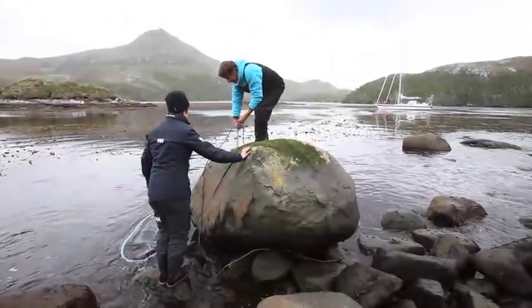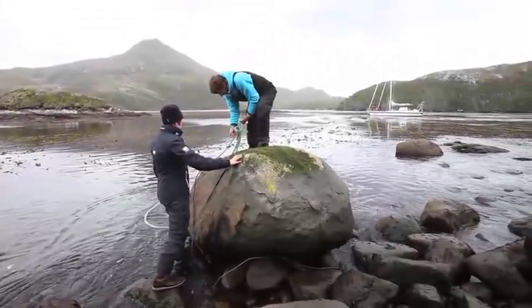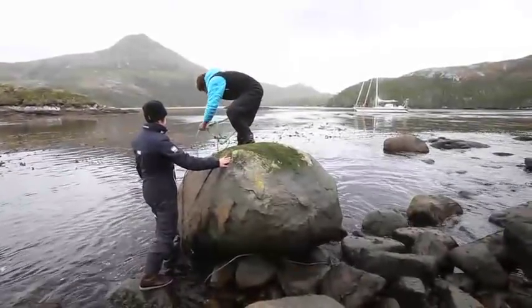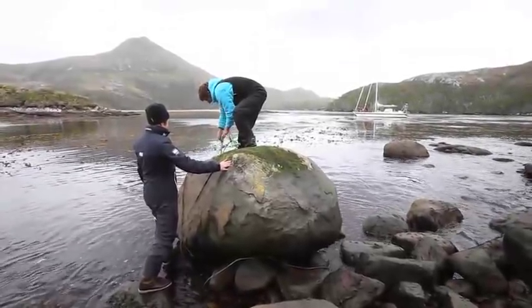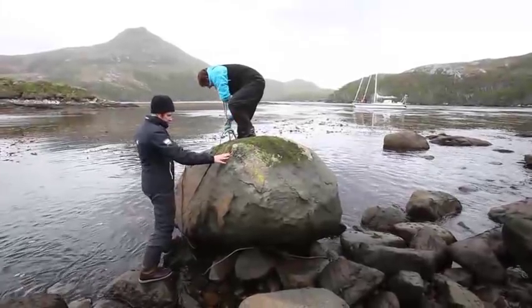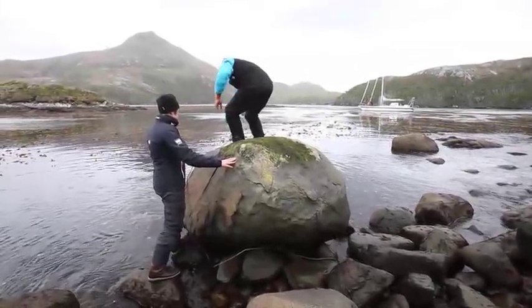And what we usually do on this is, rather than tie a bowline, do a round turn and two half hitches, because it's always easier to untie that, because you've got all the loads taken up by the round turn. And you can release it under load if you have to. Okay, made!